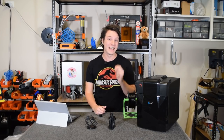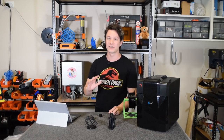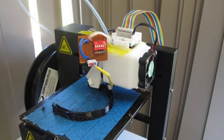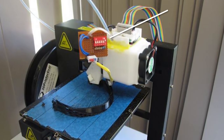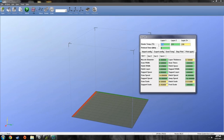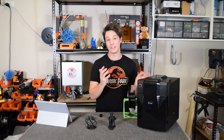Either way, there's no question that this was intentionally done to try and encourage you to use their brand, because you can't change the printing temperature in the old slicer from a few presets and none of them are designed for generic ABS. At least they didn't use chips to lock you in to filament though. Early hacks to get around this included using a resistor to trick the thermistor into thinking it was a different temperature - I used a 12 ohm inline resistor to make it heat up at a lower temperature. And some clever individual on the forums made a DLL which would go into the folder of the slicing software and intercept temperatures and change them when you sliced. All very hacky, but it made this machine fully workable using generic ABS.